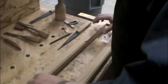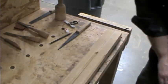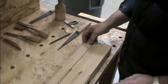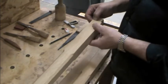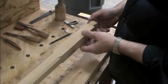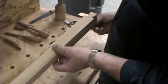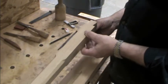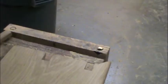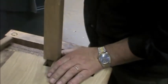This one is going to follow the rake of the stair going up and they'll all be in line, so you won't have that up-and-down jumping look to it. We now need to cut out the shoulder on each of them. Having cut that shoulder — this one was determined to be a quarter inch — it has to match what you have in the tread. We'll then lay it over and place the baluster with the shoulder directly on the mortise.